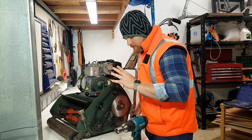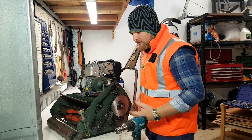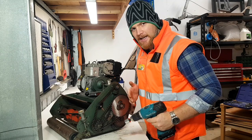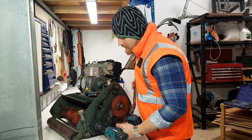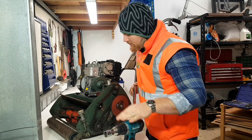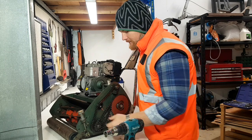So look, nothing to be afraid of. It's all really simple once you've been shown how and you've had a look and a play for yourself. All right, so when we're backlapping, you can target either nut. So you can target this one, or you can target this one. It doesn't matter because the reel's always going to be spinning. So whatever might make it easier for your ergonomics in the situation when you're grinding.